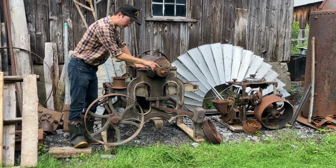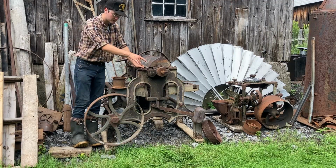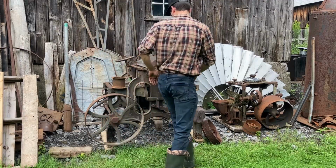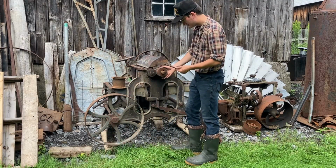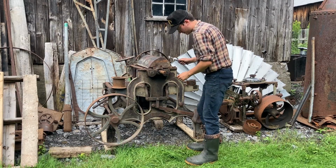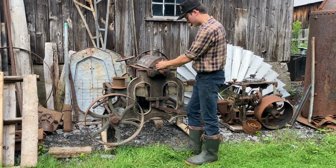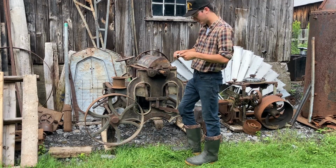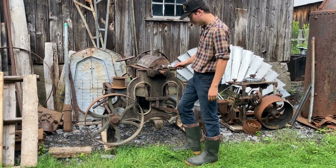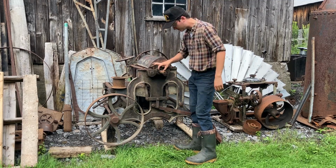So main thing today is to fit this drive pulley, which I found elsewhere, to this shaft. It's a very strange size of shaft, and it has this key. So I took the dial caliper and measured all around it. It's all over the place. It's like 1.436 and a strange measurement, kind of all out around, and you can see there's a step.